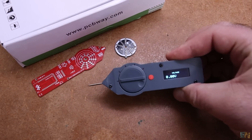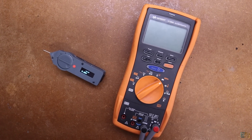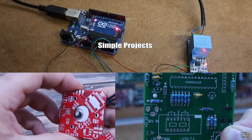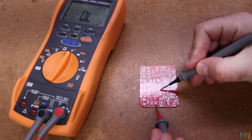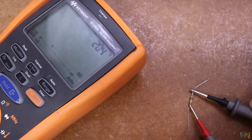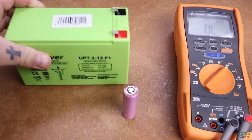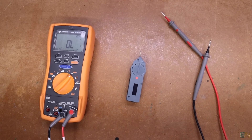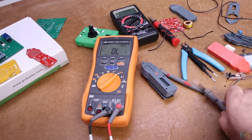So why is this multimeter better than others, or at least in my opinion? Why not a commercial and professional multimeter like this one? Well, it depends on what use you give it. My projects are not that professional — I don't usually work with CAT3 600V or any kind of high voltage, so why would I need such a professional meter? 90% of the time I use the multimeter in continuity mode to detect short circuits, measure resistance and capacitance values, or check diodes and LEDs to see if they still work. As for voltage, my projects usually work at 5V and a maximum of 24V, so I don't need a high voltage meter. And best of all, my meter is very small — and when I work, my workshop table is usually full of stuff: components, parts, PCBs and much more.